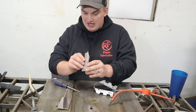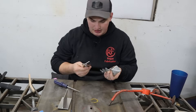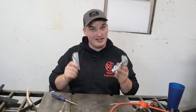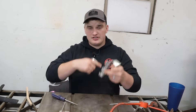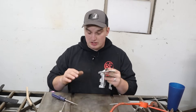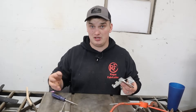We were able to separate it — it was actually pretty strong. You can see how much: this was a flat plate and I had to deform it and lift it up that much before it actually delaminated. I'm actually semi-impressed having those two dissimilar metals. Just for clarification: this is soldering, it is not welding. The primary difference is welding is more of a molecular bond and soldering is more of a mechanical bond. When you're welding aluminum you're melting your two base metals and adding a filler — everything mixes molecularly. Whereas soldering is more like glue — you're relying on a mechanical bond. That's why it's really important to do good prep work: maybe do a little sanding, scuff it up, get all the oxides off, and decontaminate from any oils, just like you would when you go to glue something.